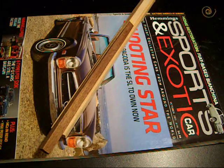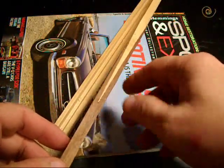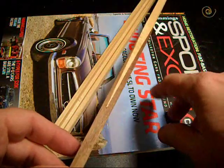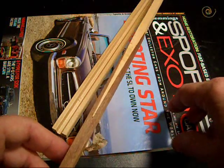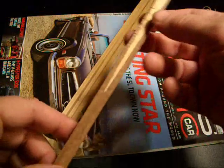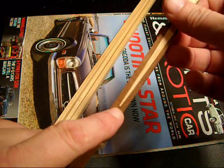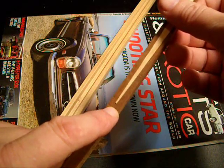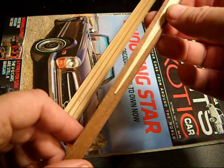When I last left it this morning, I had the clamps on and had glued the footing onto the arrow. Since then I took the clamps off, put a straight edge along here, and trimmed the sides with the bandsaw to get it near flush. Right now it's a little asymmetrical, but I'm doing the best I can. I did have a slight gap down here on one side — worst case I'll glue a sliver of black walnut in there. Now I'm down to the part where I need to make this square into round.